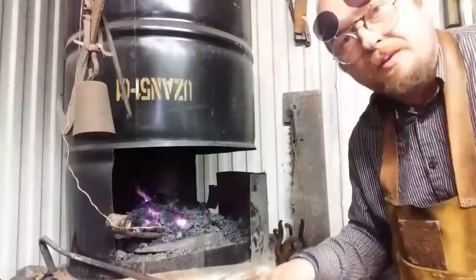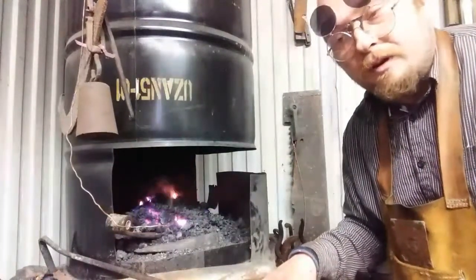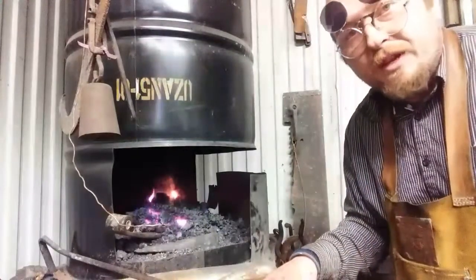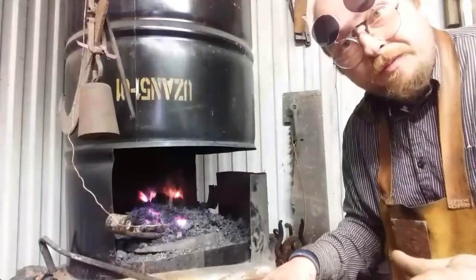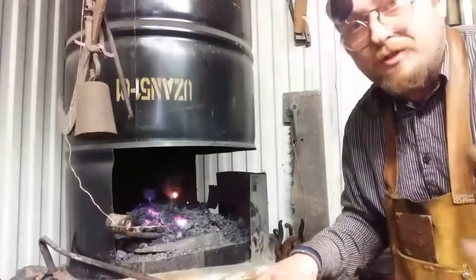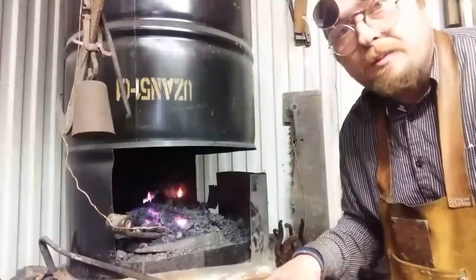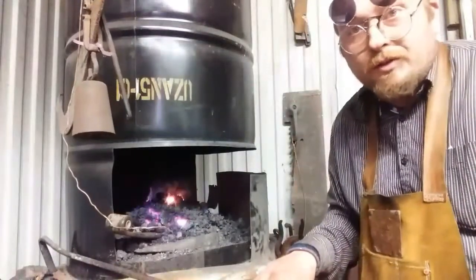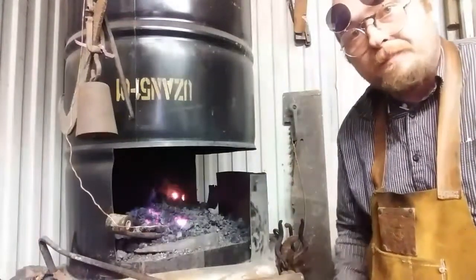Set it in a place like on the brick, somewhere where it's not going to get quenched off or cool too fast. This spring steel is pretty forgiving, but just black doesn't mean cold. Just remember that. If you walk into a blacksmith shop, into the smithy, and you see a piece of steel, don't just grab it. It could have just been in the forge 5 minutes ago, and it'll be black as all get out. It'll look like everything else, and you'll severely burn yourself on it.